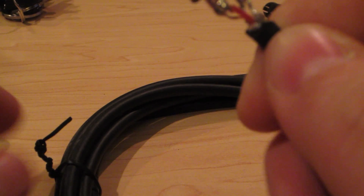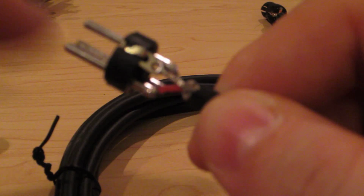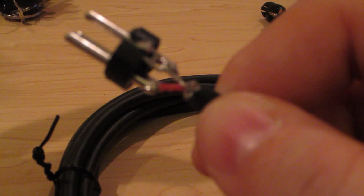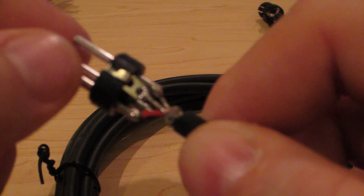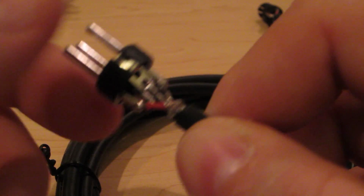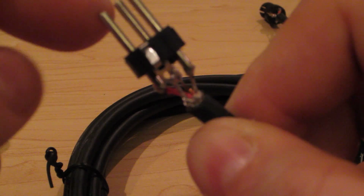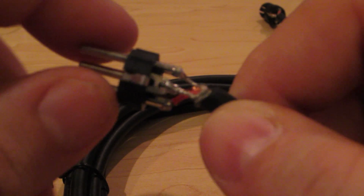you know, Mighty cables work for us, but I will not be purchasing any more of their cables after having to go through and cut out incorrectly soldered cables and redo a handful of cables myself. I don't have the time of the day to waste on fixing cables. So there it is. If you guys are having issues, cut out the ground, the pin number 1 that's been soldered to the housing, and hopefully that should fix your issues.